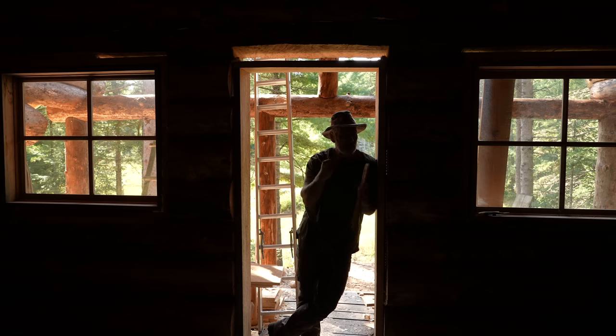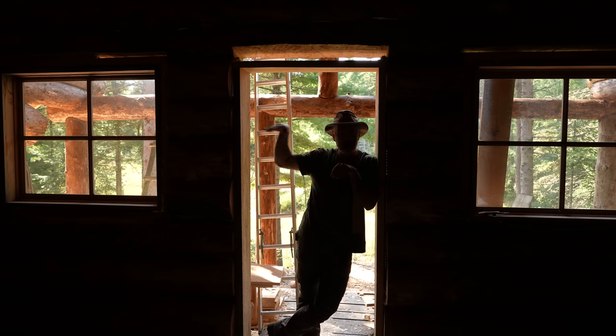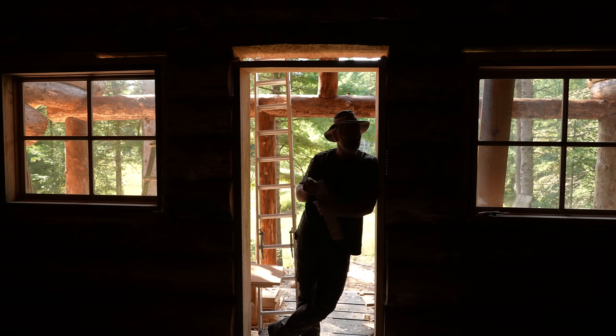I'm not sure if I can do the breezeway right now. The cabin is likely to settle about five inches, so if the dormer roof is built higher it would just be a tie-in between the two that comes down and meets at some point in the future. The problem is I'd have to guess that exact settlement drop accurately, so maybe it'll just be a little rubber tie-in between the two anyway. I'm going to try to get that done before winter and get the footings in for the outdoor kitchen as well.